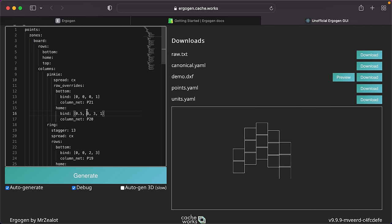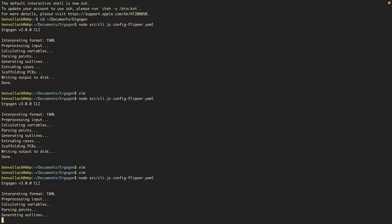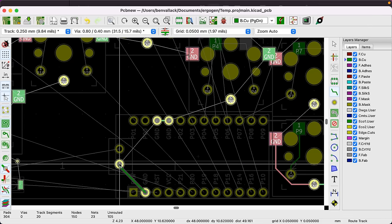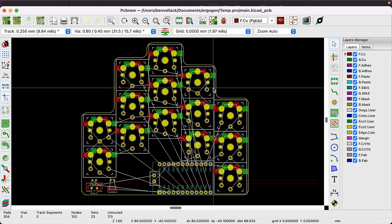The next step is where we get the big guns out — the centerpiece of this whole process: an amazing bit of software called Ergogen. This lets you quite easily design all the CAD files you need to get a PCB for your custom board printed, and seeing it take shape in front of you is super fun. The third bit of software is KiCad, which is the PCB layout tool for which Ergogen makes the initial files. The last step is routing in KiCad — designing where the connections between components go — and everything up to there is handled by Ergogen.